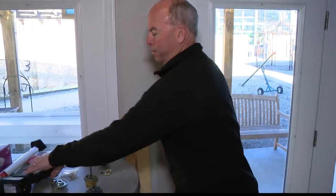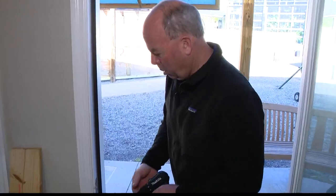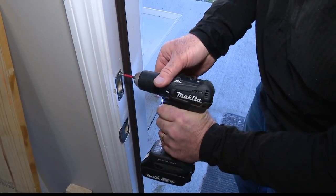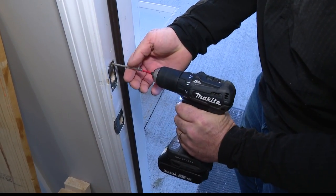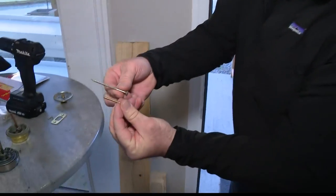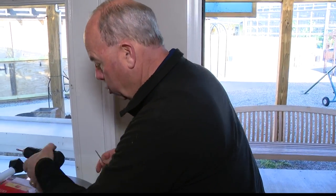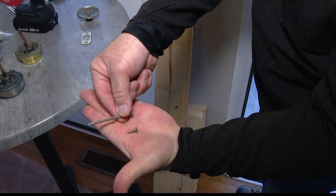So this deadbolt here is on one of our buildings, our Keystone store. Look at the size screw — there's your difference. There's the difference in the size. It's just been in the last few years they've actually made them this long. They used to be just the shorter one — this was all that it was. Look at the difference. As you can see, this one gets into the frame.